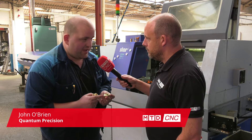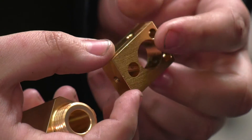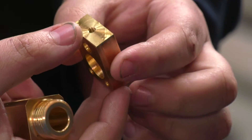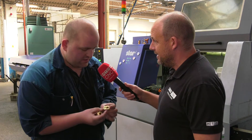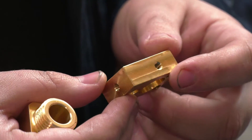This used to be made out of billets and used to take weeks to do a run of 500. You'd be turning each face around — so you had a machining center, lots of vices, maybe doing 15 to 20 op-ones, then turning them all over for op-two. You'd align them all up, set them in the jig, press start, and do 12 at a time.